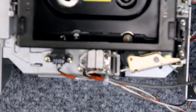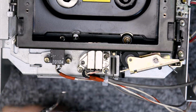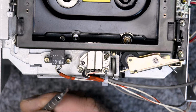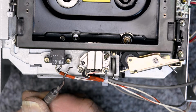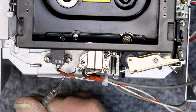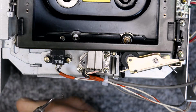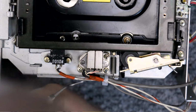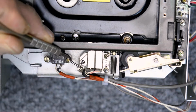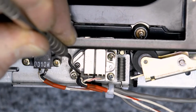So I'm going to take an old dental pick, a broken one, and just regrind a little bit, and put a little bit of a wedge on it. I think what I can do is get it on that record head mount bracket, or the mounting flange, between that and the bracket, and just pry it up a little bit. This is on a spring so that they're adjustable independently. I guess that's called discrete.